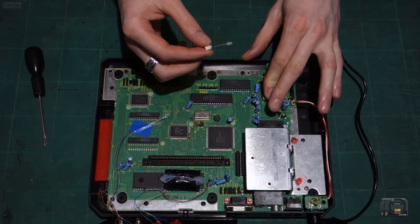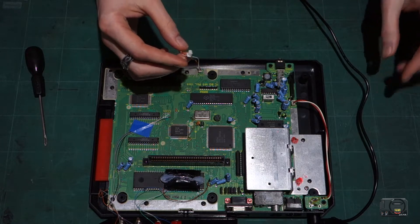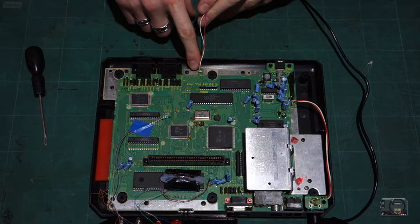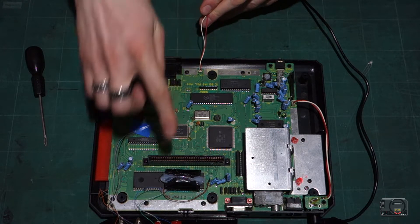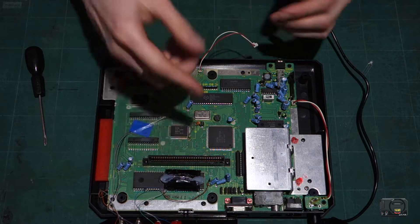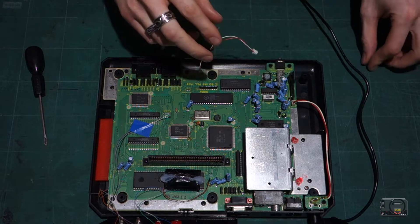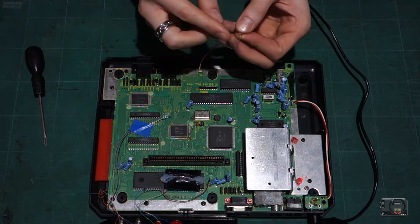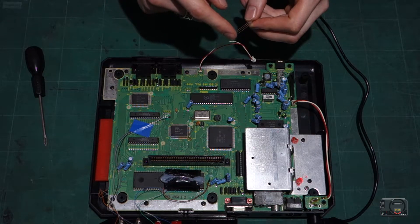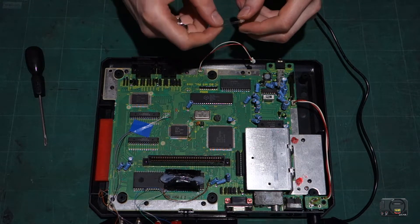So next what we really need to do is start cutting our cables to the right length. What we're actually going to do is take our live from this source and feed it straight to the switch up the back here, straight to our overclock switch basically, and then we run two wires off the switch directly to our LED - one to each leg. Then we take our ground from here as well, and that will go soldered directly to the LED. So I'm just going to quickly prep for that and then we'll come back and start the soldering process.